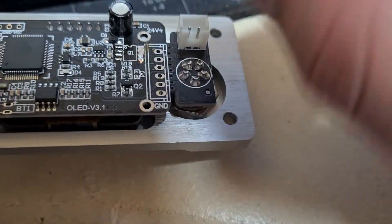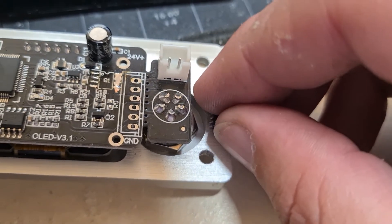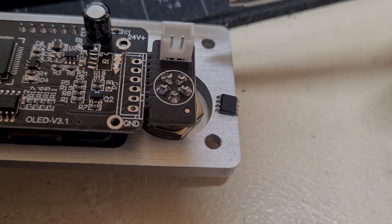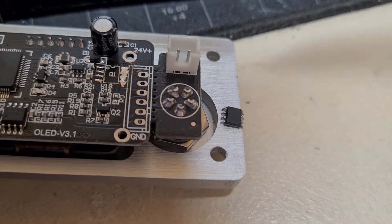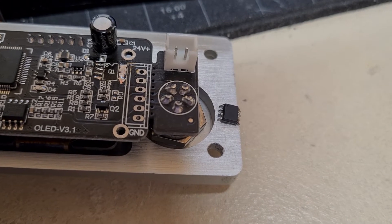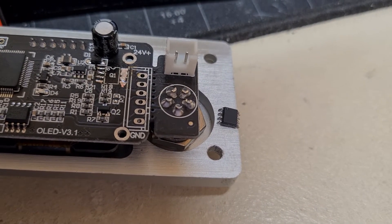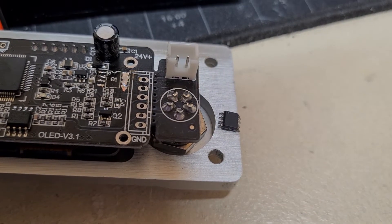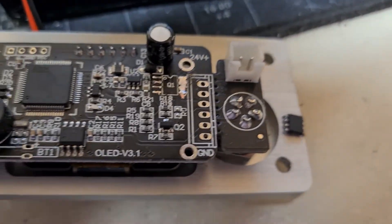The actual part — just tucked in here — is just a little SOIC-8 part which I've desoldered. I'm waiting for another one of these to arrive. It's a TPC8107 — Tango Papa Charlie 8107 — is the part number, and it's just a P-channel FET in that package.